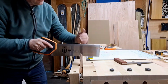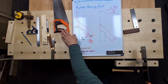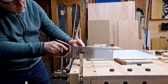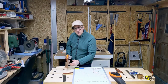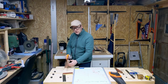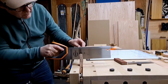If you find that you're doing a very long angled cut in here, and you've started with the tenon saw, remember to jump on to the panel saw. With so many markings out on this cut, you want to take your time at it and remember where to stop. Quite often I see my students have cut all the way through and they've cut further down the line they're meant to cut. So really take your time at it and watch out for it.